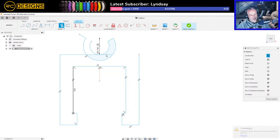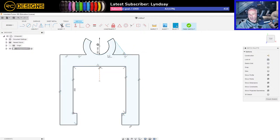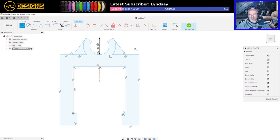All right, so that looks good there. Lost my line up there. Switch that back to solid. Not too keen on the sharp angle in here, so let's at least go halfway and bring that up. All right, we can chamfer in that area under here. This one goes, that one goes, or fillet, sorry, and make it look nice. So put a little 50 thou radius on there.